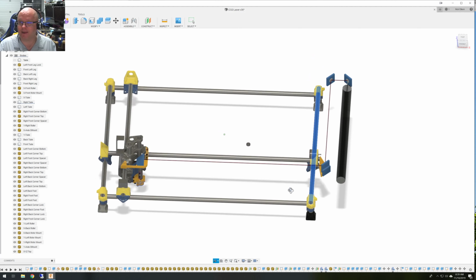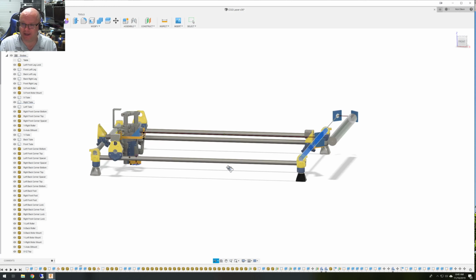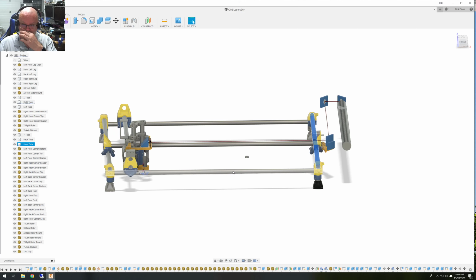And I think next time I'm going to mount it under the table. I'm going to take the tube and put it under the table over here and probably have it shoot with the mirror zero up and hit this mirror and start things off, because it'll conserve space and it'll keep my tube out of the way of things I'm working on. I almost dropped a wrench onto my glass tube and that would have really sucked. It would have destroyed my lasing ability until I could get a new one. So having this covered up just to protect the tube would be much better.